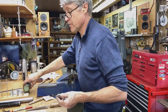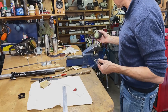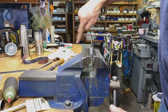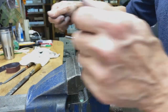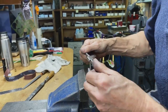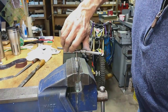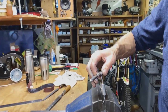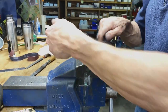I have to make a thread. I've got a 5mm tap. This is Anchor Lube — it's a tapping compound. It works well, so you put a little bit on each side. In the old days I was taught to tap half a turn then go back, then do a bit more and go back — that's because you have to break off the chips. But on these new taps it's a spiral point tap — it drives all the chips down through the bottom. That means once I start to tap I don't have to stop. I can just keep on going, so it speeds up the tapping a lot. There you go — you've got a good thread.